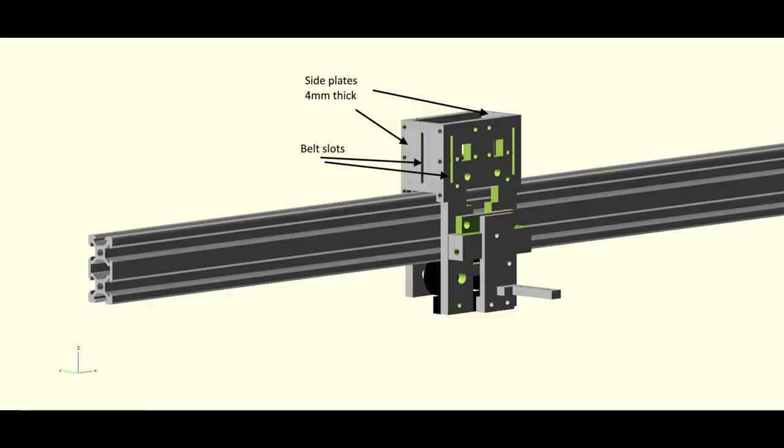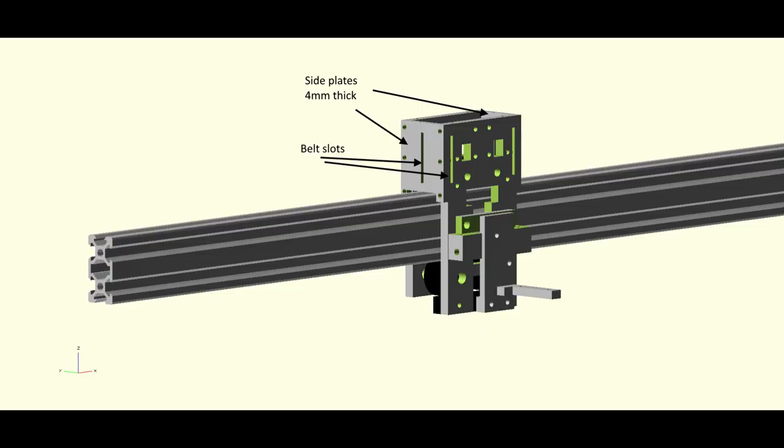The beauty of this is I'll be able to build the entire printhead up as a unit with the tool board included. I can wire the heater, thermistor, part cooling fan, Z endstop switch, and motor all together as a unit, and when I come to fit it on the printer the only thing I'll need to connect will be a CAN FD lead and power. The side plates are basically where the belts go in. The belts run directly above each other, dead in line with the X axis, going in through those slots, then bending at 90 degrees and going out the front of the X carriage.